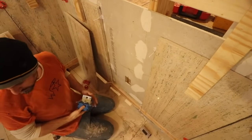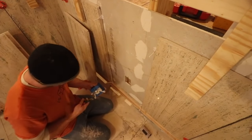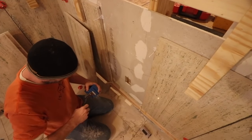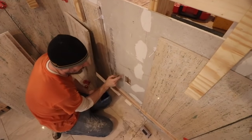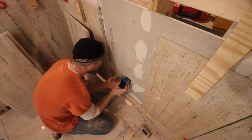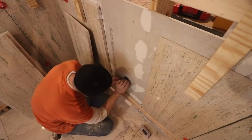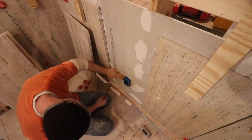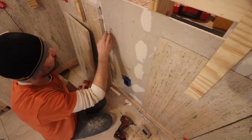These little things here are usually made to go around a stud, but I'm doing things a little differently. All you do — at least all I've done in the past when I've had to do something like this — is bend those up and flatten them. All I did was flatten them. And now I have a stud that I put back there and I'll be able to put this box right in there. Perfect.